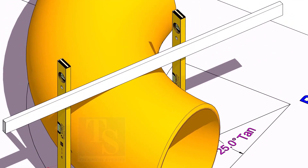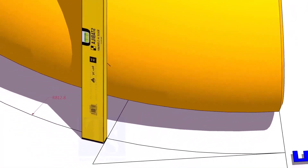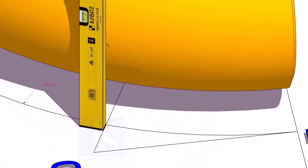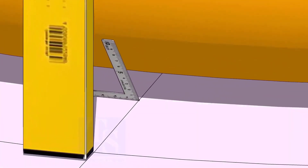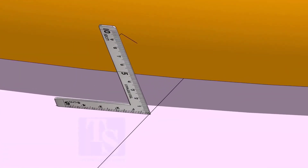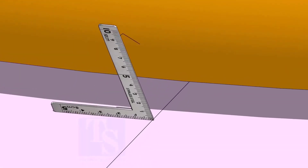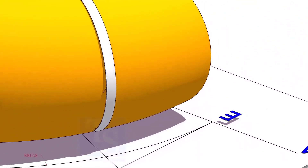Put a scale or a square box on the top of the elbow, touching the faces of the level bottles, and mark on the top side of the elbow. At the bottom side, use a small right angle and transfer the line to the elbow on both sides. Use a bend scale and connect the marks to form a circle around the elbow.